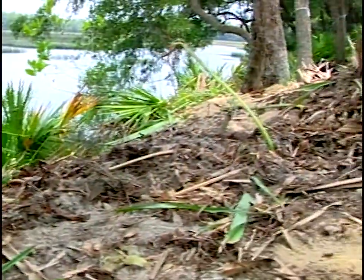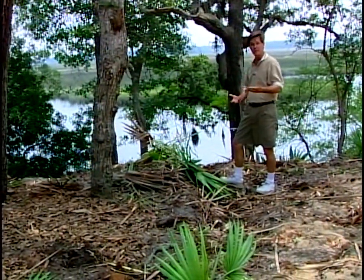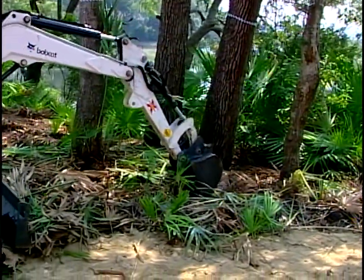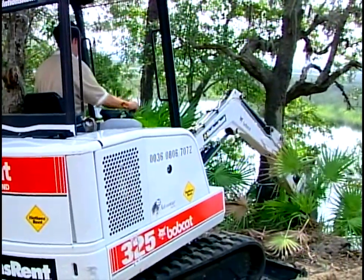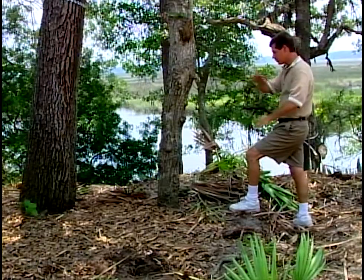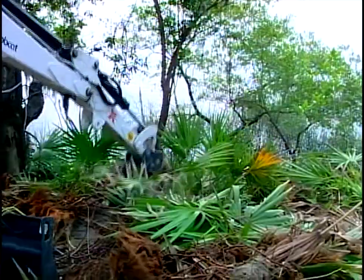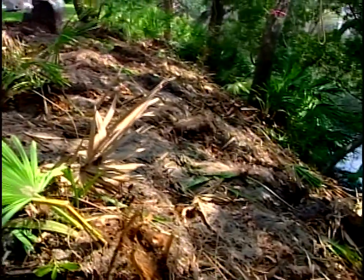The pool guys left a big clump of dirt and a hole, so we'll be doing some grading here. Now with the palmettos really removed, we can see what our existing grade is. We brought in a track hoe and I'm going to use it to do some clearing over there. We wanted to rake very softly around these tree roots in order not to scar them up. The bobcat track hoe had rubber feet on them to ensure not doing too much damage around the surface of these tree roots. Digging very carefully allowed me to come out to the edge of the bank and grab as far as we could to pick up these big, long spider-like palmettos that are native to this Florida climate and establish some open character.